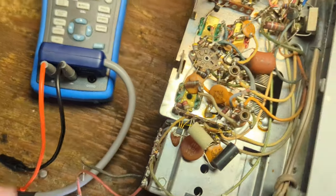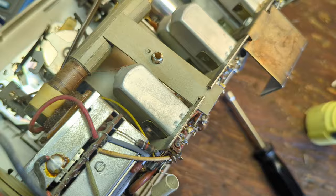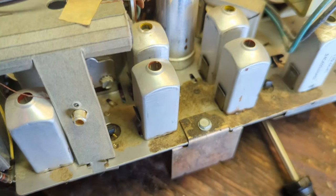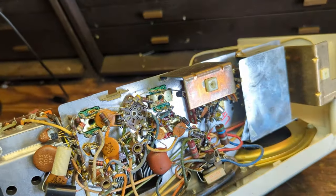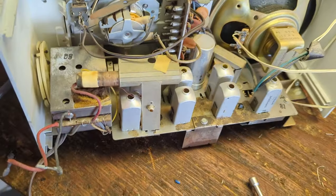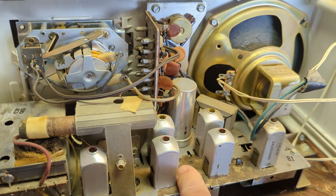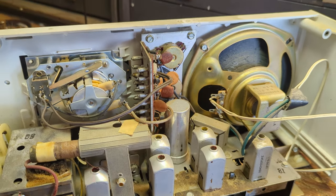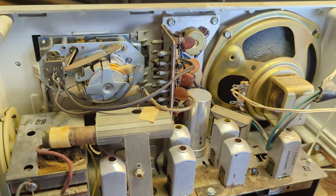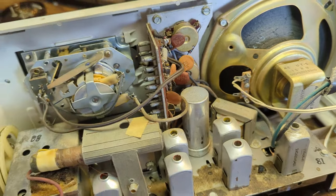You know what's really weird? They're using tube sockets for transistors! What the heck. I wonder how old this is — I wonder if it's early solid state, because the way this chassis is built is very reminiscent of tubes. You've even got the proper spacing where you'd put a tube here and a tube there. I think this is early because the designers were probably tube chassis designers, used to this kind of construction. Anyway, first things first — I'm going to replace those. This little gray electrolytic I wouldn't trust either, but I'll test the ESR on that one too.